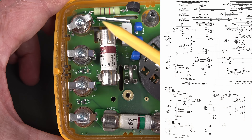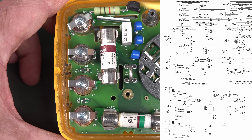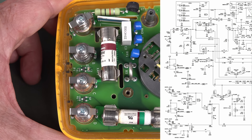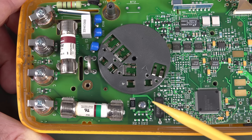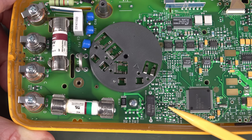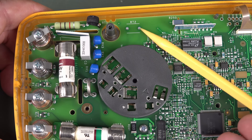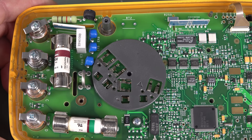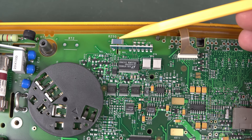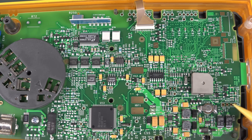We see the isolation slots all around here. We've got our fusible input resistor, a PTC, and three MOVs - they're not huge, but there are three MOVs. There's our 10-amp current shunt. I'm not seeing the diode bridge for the fuse protection - usually you have one of those. Could be on the other side. There's another PTC up here that's missing, which is interesting.